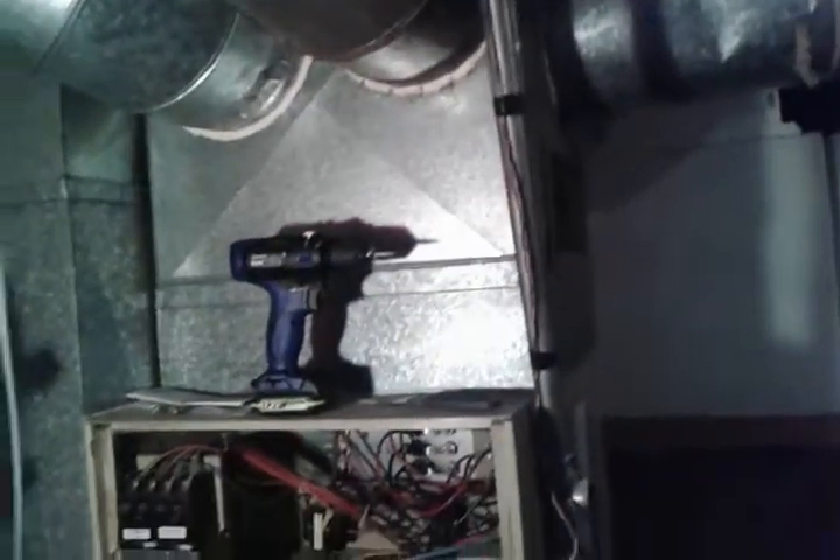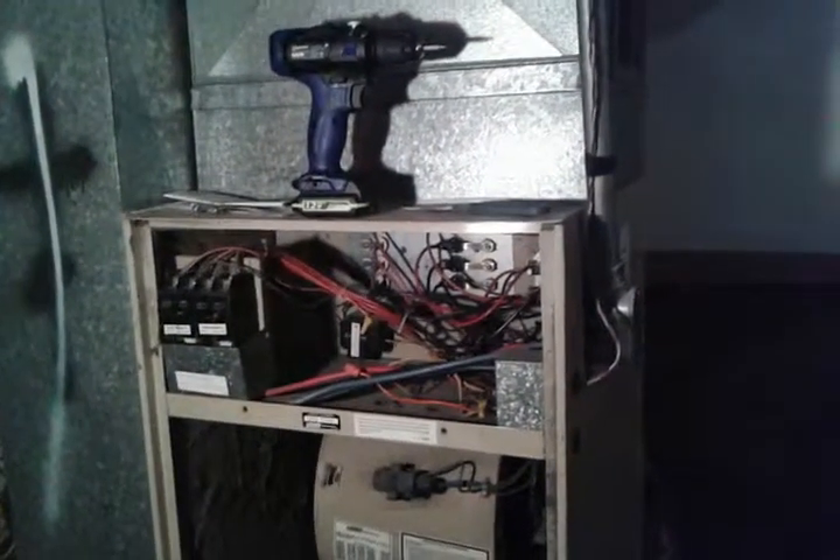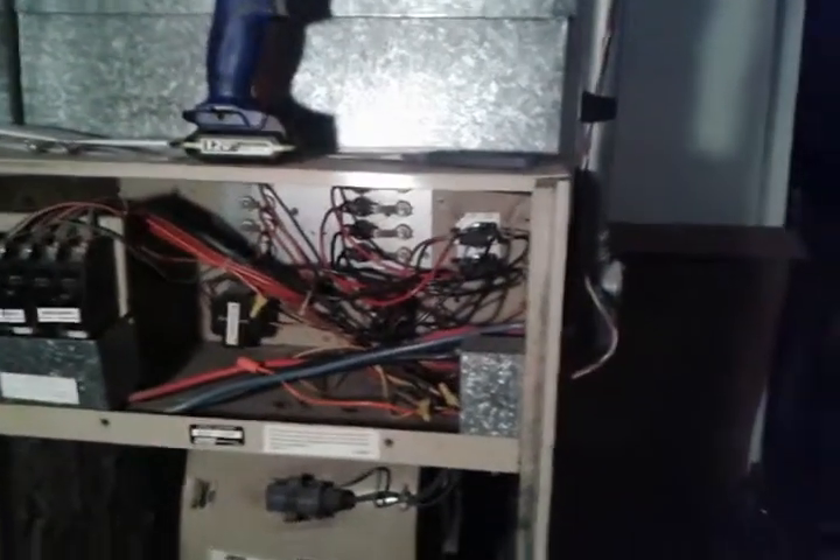These ducts go off to different rooms in the house — there are four of them coming out of here. Each of them has a little damper. This is a really old house, so some pretty old work here. But they've got these dampers where you can actually feel them cutting off the air. So if you wanted to cut off air to one of the rooms, you could close the vents from upstairs, or come down here and shut those off as well. If it's a room you don't need, then you're not wasting energy making that heat.